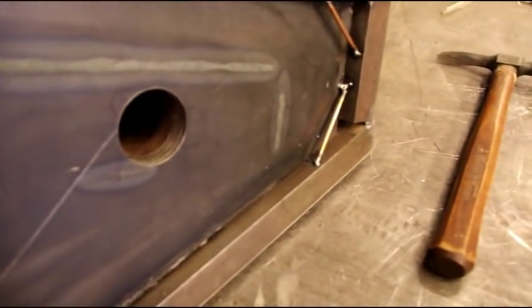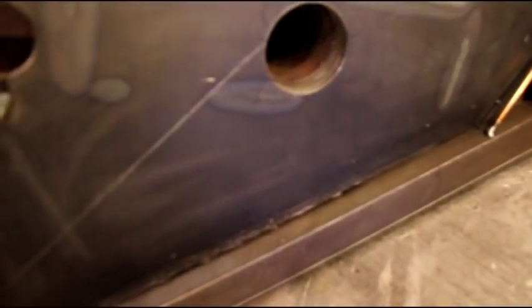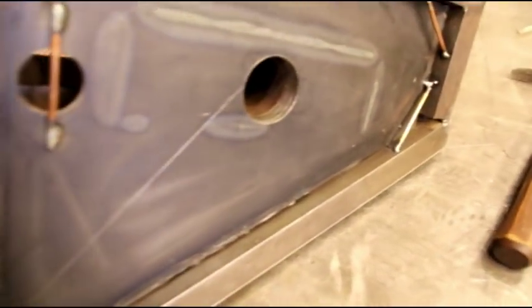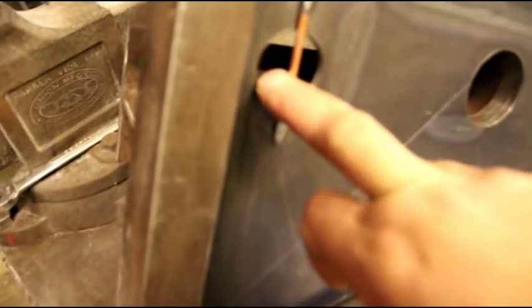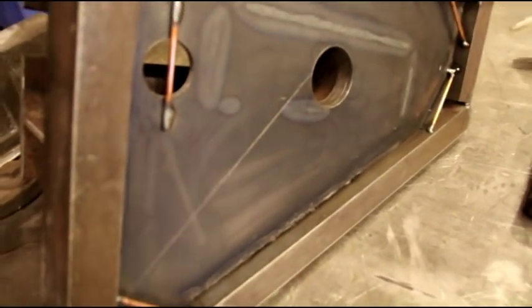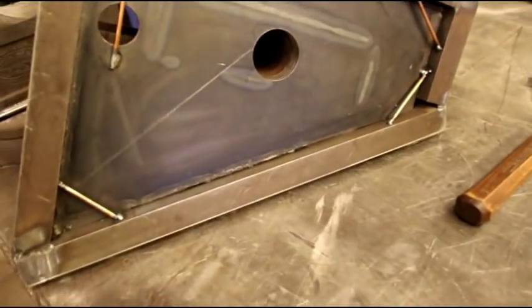That's why we pour everything in the jig, you know, it's lined up and stuff, so it makes a perfect mold. This is where I'm going to fill from. This is a little vent, and like I said, these are little grabbers so that the material flows around there and grabs onto that. So I'm going to get the top on the bottom, and then I will show you the mix and how it gets mixed and poured. So let me get set up and we'll keep moving on.